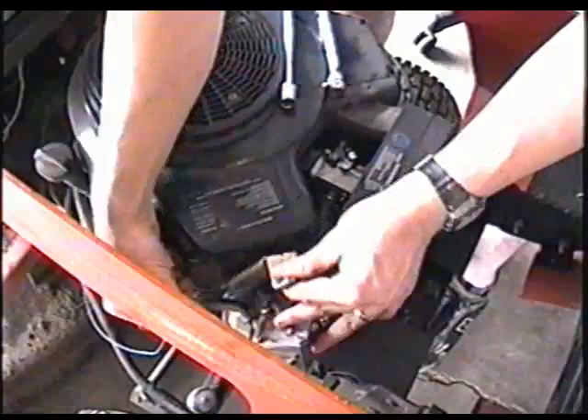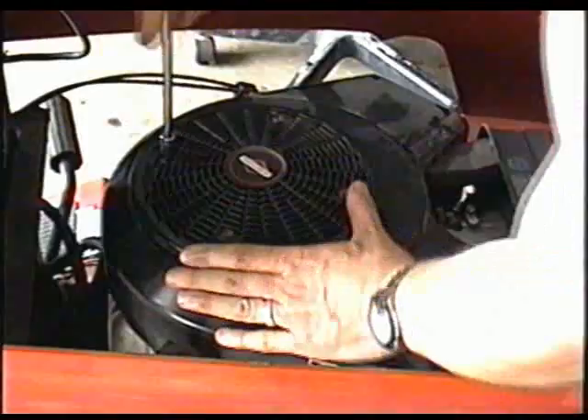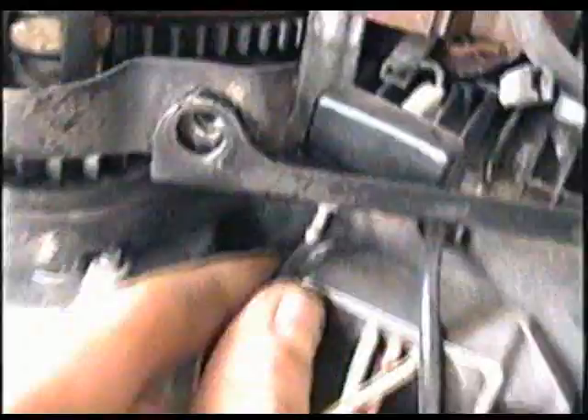Now this bracket is going to come off. Also I have to remove the four 5/16 bolts on top of this grille here. Now that you've got all the bolts off, just simply lift the cowling up. And what the problem is — this little diode here. That's the little diode which has the tab that the wire connects onto on the other side, and that's for turning the ignition off when you're done using the machine.